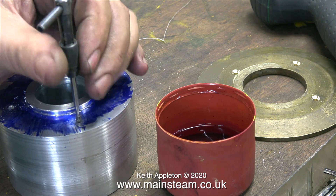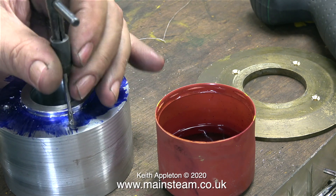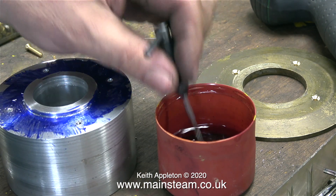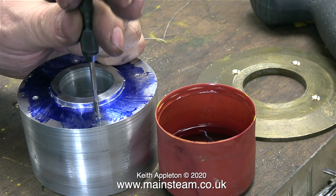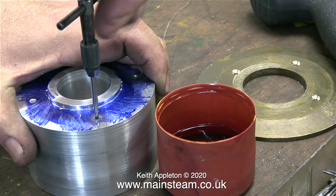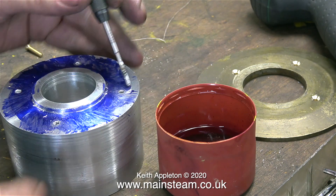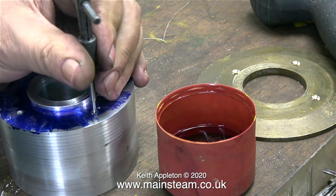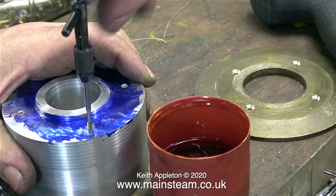The other reason for deep holes is to allow swarf from the tapping process to drop to the bottom. When tapping, it's still two or three turns in and then one turn in the opposite direction to clear the chips. Aluminium is very easy to thread — it's quite a soft metal — but it can grab the tap, and if it does, when you try to wind out the tap you risk breaking it, especially in deep blind holes. The tapping technique and lubricant very much depend on the metal: you don't need lubricant with brass or cast iron, but if the tap starts to squeak with brass, apply a little oil to reduce the risk of snapping the tap.